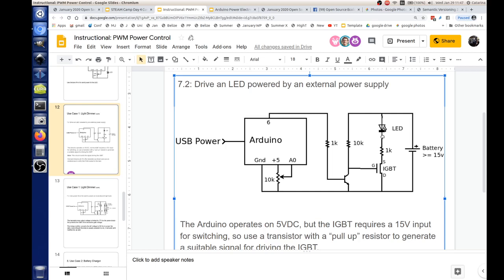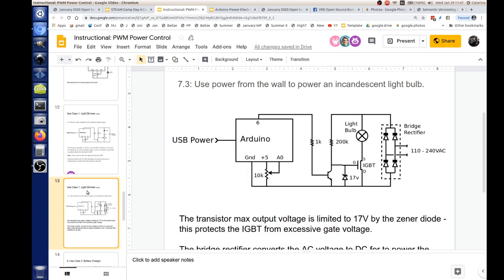So that means you have to program it in reverse, like when you want a lot of power, you do a short duty cycle. All you do is reverse the labeling on your potentiometer. Instead of max, min, you just swap them. Okay, all right. A little trickery. Yeah. I like it.